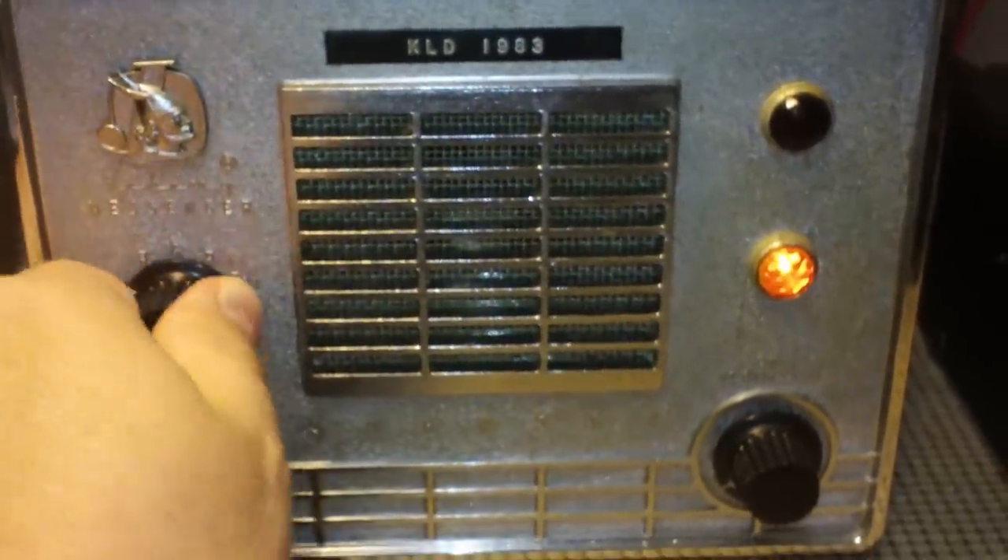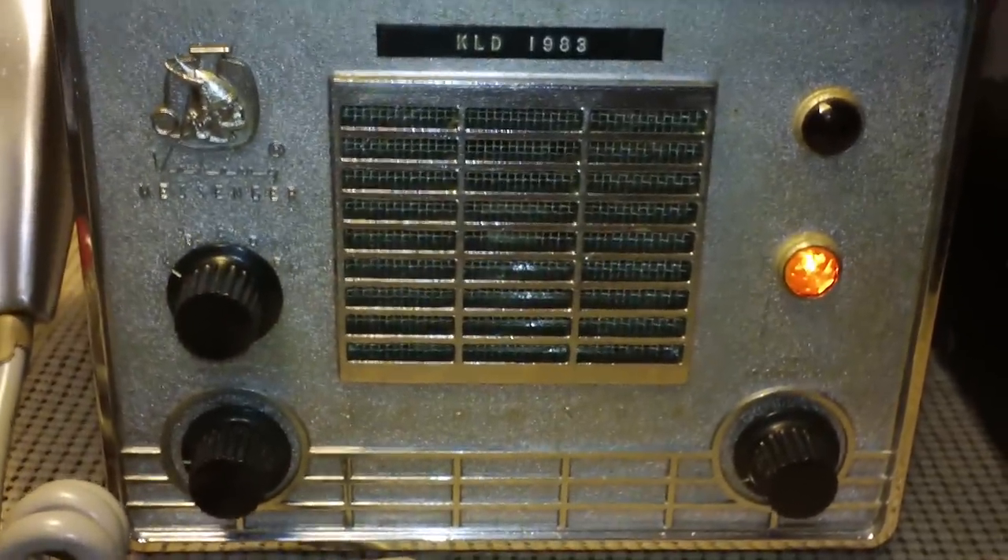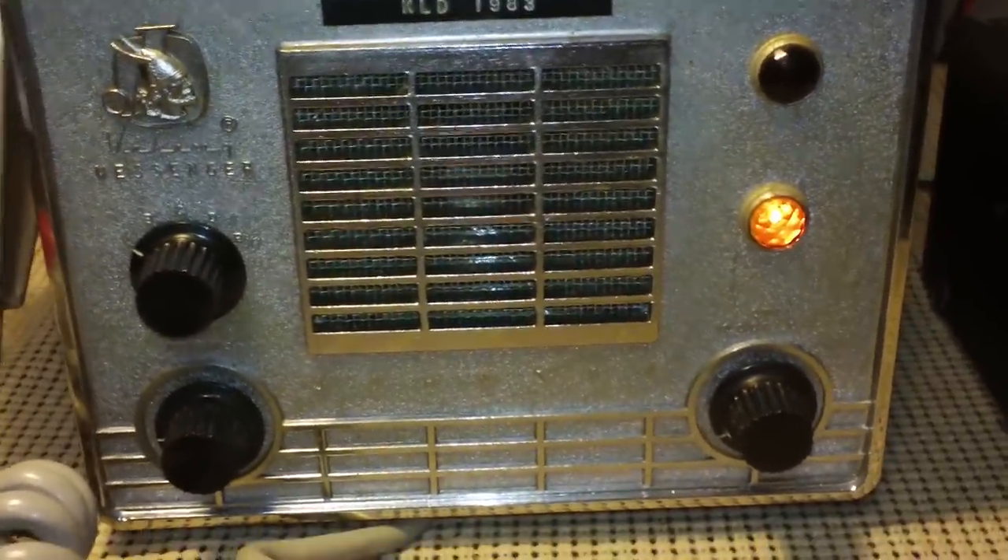I have the cover for the crystals but I left it off. I'm going to have to take it apart and get some Deoxit and hit it again. I replaced the electrolytic capacitors in it and I had to clean the relay. The varnish, tarnish, and oxidation on it was causing me all kinds of problems, but really that's mostly what it took to get this rig going.